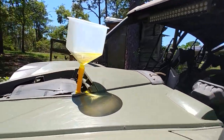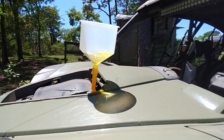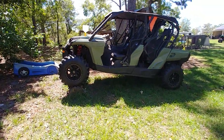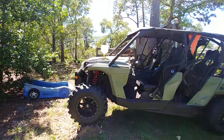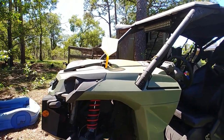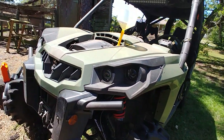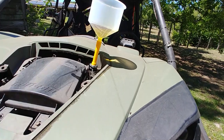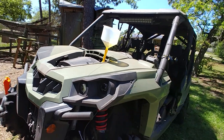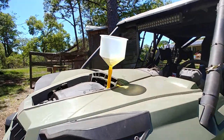What should happen is, with all that antifreeze in there, we'll start to see some bubbles come out where the air is trying to escape. I put it up on the log there, essentially trying to make that part of the radiator the high point. That way, as the air flows through everything, it escapes out of that. If you don't have one of those tools, the air will probably push the fluid — it just comes out and you're never able to keep enough fluid in the system, so your machine overheats.